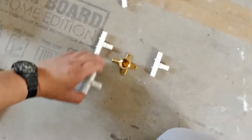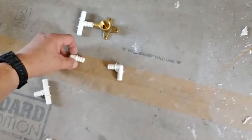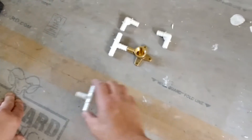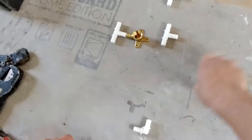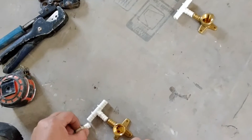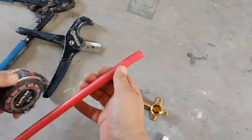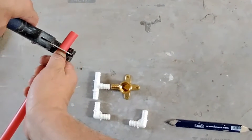The spacing is at 0, 12, and 24 inches, and what I want to do is create a loop so the water will be distributed equally throughout the entire shower system. If you have better pressure, you may work with four or five different jets in different places inside the shower. The PEX piping is really comfortable to work with — you can cut it with this kind of PEX cutter.